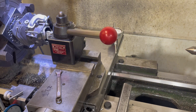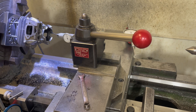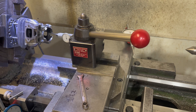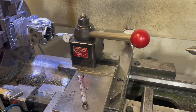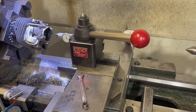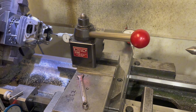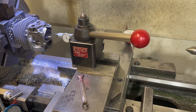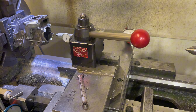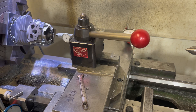That looks good there. Let's run up the exhaust port once again and see how bad we are. Here is an interesting case where it has a divot underneath the intake port, so you can't actually circle the whole way around. But that's well within tolerance. We've got about a thousandth of runout up here, and it's happening identically on both sides — it's actually just honed out a little bigger underneath the transfer ports.